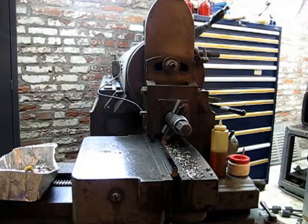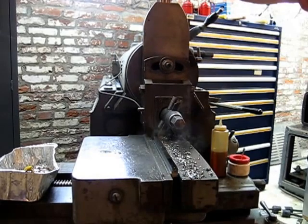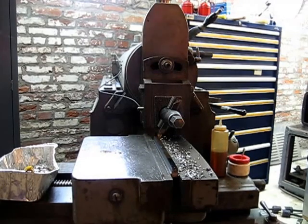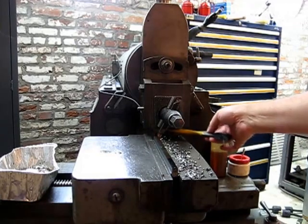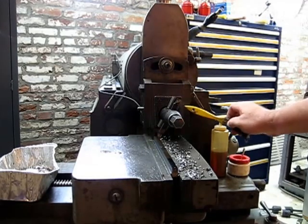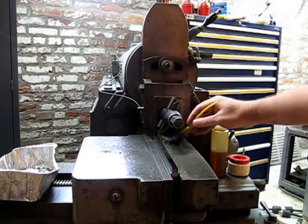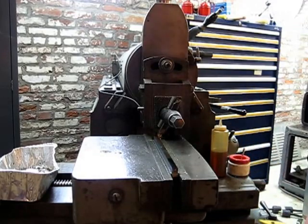All right, we're going to check the work — go a couple more steps. One of the things you might notice here is that I'm working with very little room between the clapper, the tool post, and the workpiece. A shaper is just like any other machine: the less distance between your tool holding and your work holding, the more rigidity, and the better the machine works — better surface finish, less drama, just much more improvement. A lot of people use traditional tool holders in these tool posts, which puts a lot of distance between your cutter and your workpiece, and I don't see any need for that.